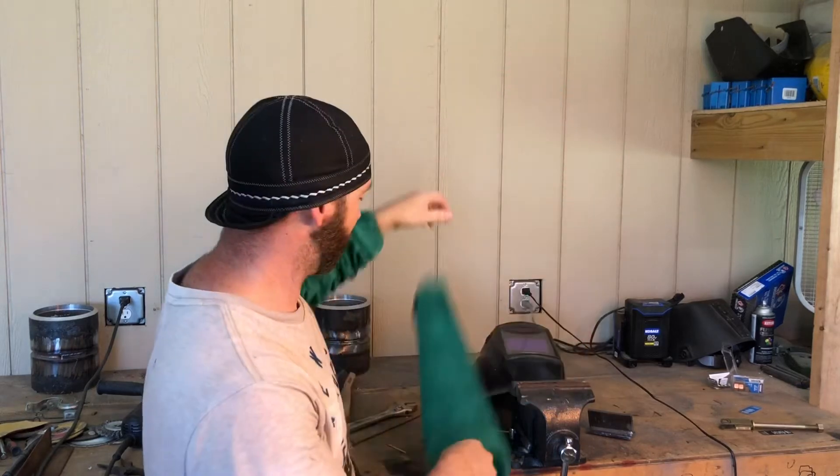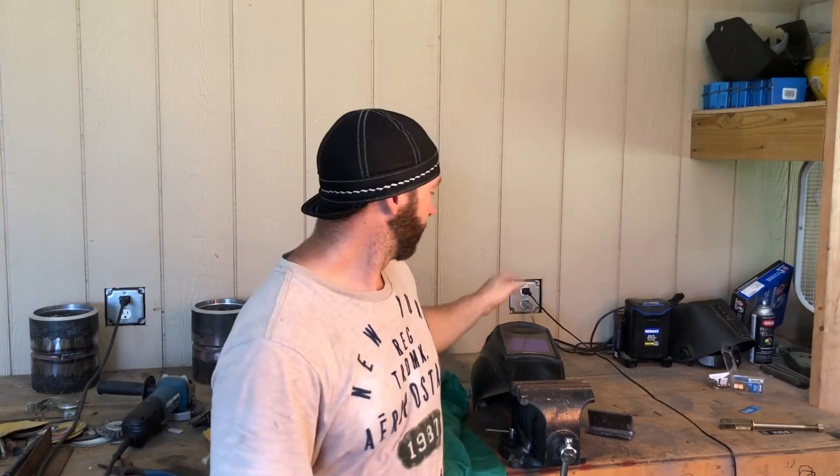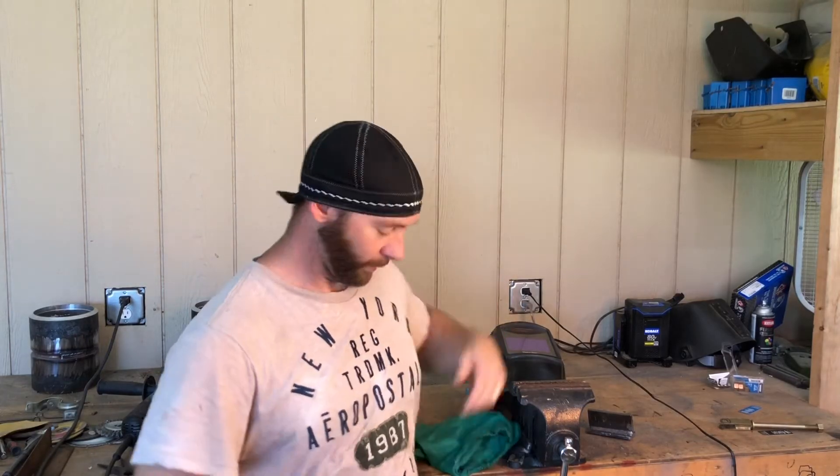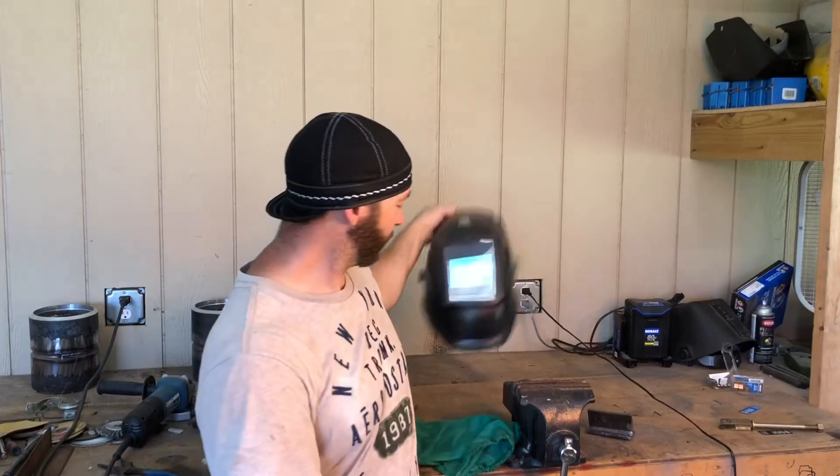So that's what you want to do — watch that edge of the puddle. Make sure the leading edge of the puddle is wet all the way down in that groove in the joint. That way you're penetrating all the way to the crack, all the way to the joint. Thanks for watching, guys. If you're interested in any of these welding sleeves, it's smoking hot here in Tennessee and I don't want to wear a welding jacket. They work great — you can wear a t-shirt, throw your sleeves on, and your arms are protected. This Miller Digital Elite welding hood — if you're interested in any of these things, I'll try to leave a link below for you. Thanks for watching, don't forget to subscribe. See you next time.